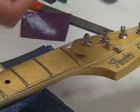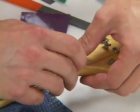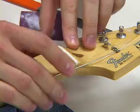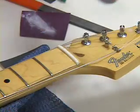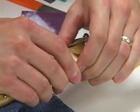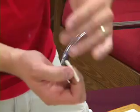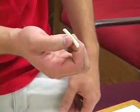All right, here we're going to check our fit and make sure it's nice and tight, and the ends are trimmed very flush. We have a good tight fit. It's seated very well across the bottom. You don't feel anything on the edges, which is perfect. And we take it back out, and we're going to go through and round over the edges nicely, go through the higher grits of sandpaper and make this very shiny and glossy before we final install.